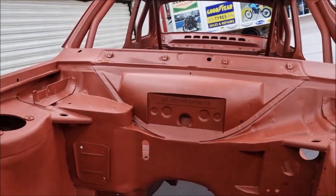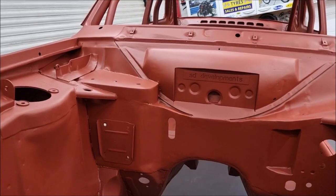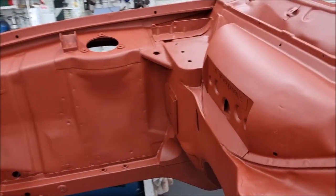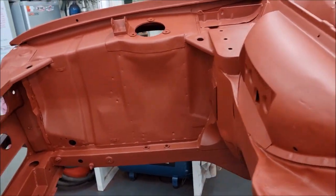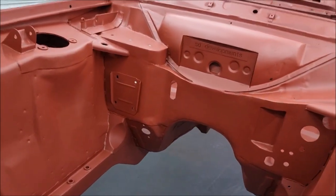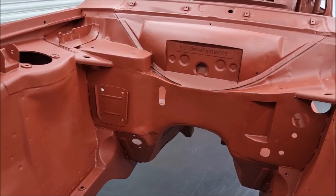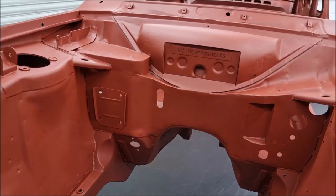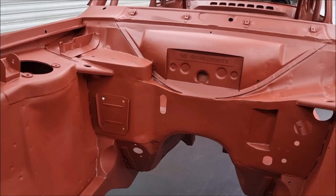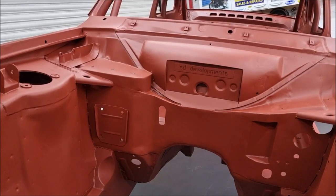Obviously the thing that's immediately apparent is the heater bubble. The bubble stuck out too far over the engine bay, and I need to get some clearance back. I'll be running a Sierra Cosworth engine with long studs, so the head can't slide off the block. It has to be dropped down over the studs, and the bubble stuck out too far and stopped me from doing that. So I set the bubble back, which created a few other problems. The heater fan being the main thing.